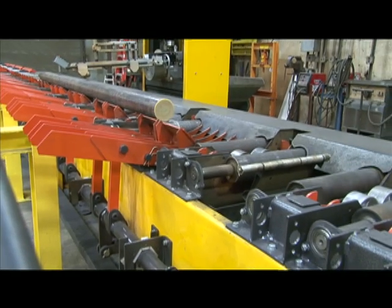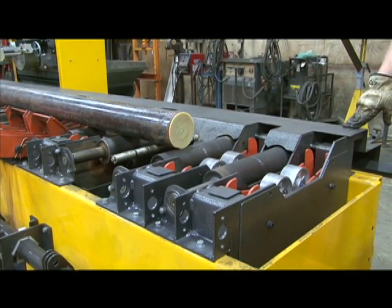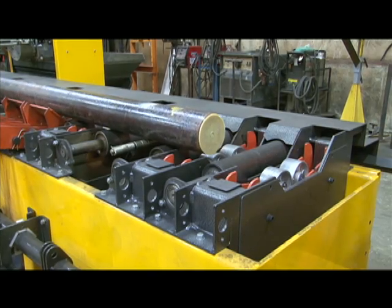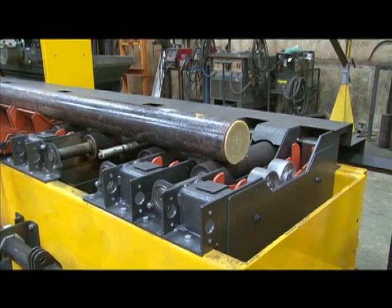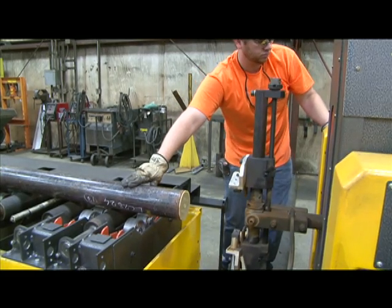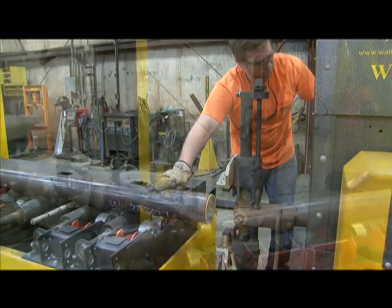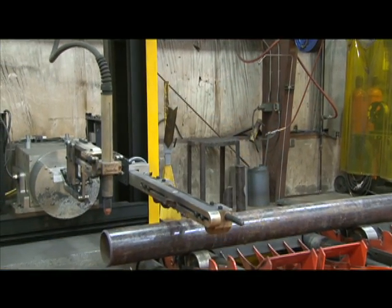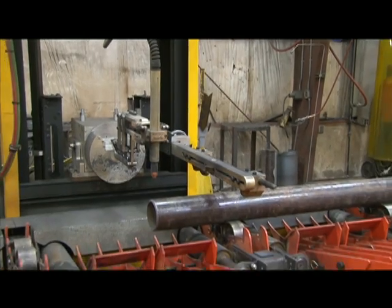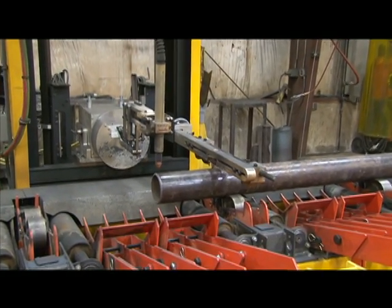The project on paper heads into the M. Davis Fabrication Shop, where the project is evaluated by our team. The pipe is conveyed into the Watts pipe profiler on fully automated rollers. The pipe is locked into the floating pipe clamp with the locking mechanism for accurate rotation, which eliminates any movement, also known as pipe walk. The tracking torch head includes vertical and horizontal tracking mechanisms to maintain torch height and pipe centerline, to automatically compensate for bent or out-of-round pipes.